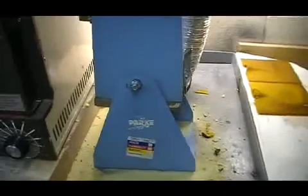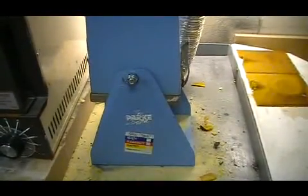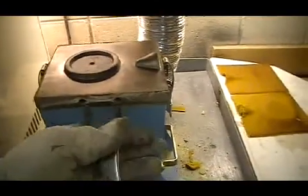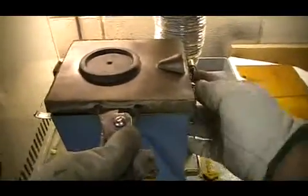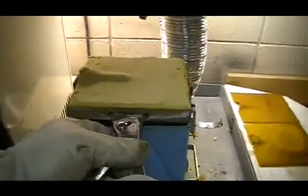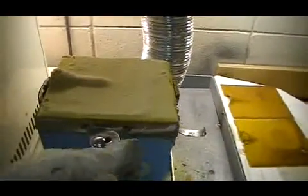So now as the sand is sitting on the top of that hot match plate, it's melting and sticking to that surface. We'll build up about a 1/4 inch thickness, and then we're going to turn this match plate over to make the other half of the mold required. We have special pliers to hold that in place. We release the latch, pick it up, and let me show you. That's half of the mold, and you can see it's built up a bit of a thickness on that match plate. We lay the other side facing down on the dump box and repeat the process.